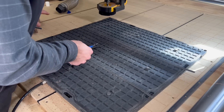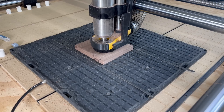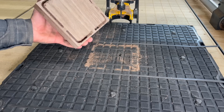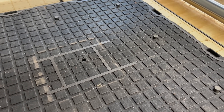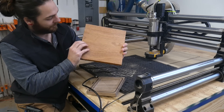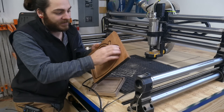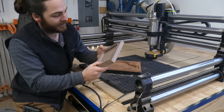Let's move on to something smaller — a six-by-six piece where we're going to cut a five-inch tray. I paid extra attention to place the gasket inside the outside profile so I won't lose pressure if I cut through. I did kiss the wasteboard but didn't actually cut into it. You need to be cautious because if you make a bunch of deep cuts into your vacuum bed you're going to lose pressure. I went about two pieces in two different ways — on one I didn't cut all the way through, leaving several thousandths of an inch so I could run it through the drum sander. On the other, since it was an easy shape, I put the suction on the inside and kissed the wasteboard to cut all the way through.